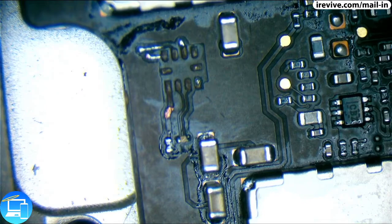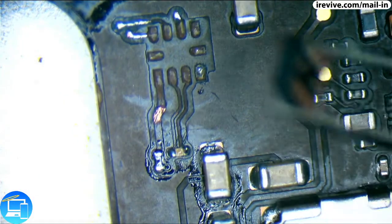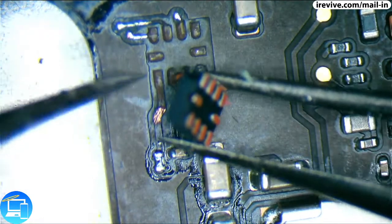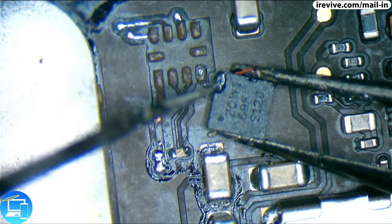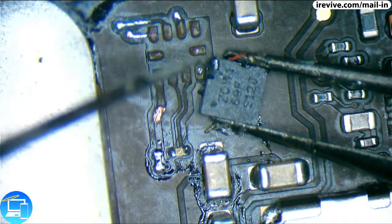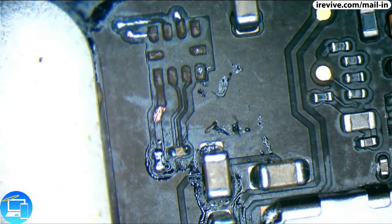Normally I would try to reuse the one that's on the board, but there's something suspicious about this corner on this chip. Well, there's flux on it now, but right here, this corner looks like a chunk of it has been taken out. Which I wouldn't be surprised, because that chunk would have probably occurred when someone had taken the bottom case off. However, I brought some donor boards with me, so we should be able to take care of this no problem.